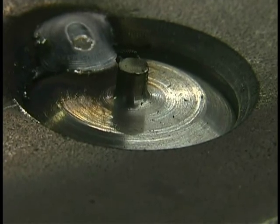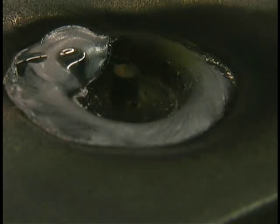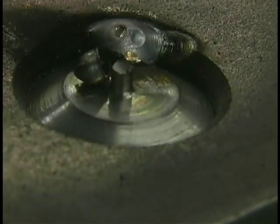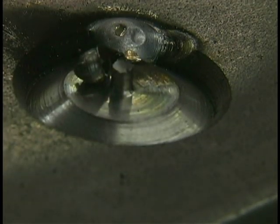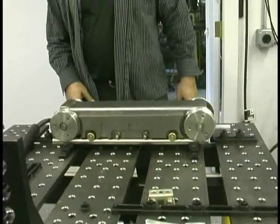I TIG welded a bunch of these — at least four side plates — but since there are like a hundred and something welds to do, and because these welds are going to be hidden, never seen, and welded over top of again to hold them in, I just had to opt to MIG weld them. You can see how quickly that goes. There's no way you could TIG weld them that fast. So even though they take a little bit of grinding to get them flush, someone else can do that while I'm welding, and it makes the job go a lot quicker. You've got to pick your battles — you'd like every weld to look great, but sometimes you've just got to settle for a good weld and move on, getting the job done.